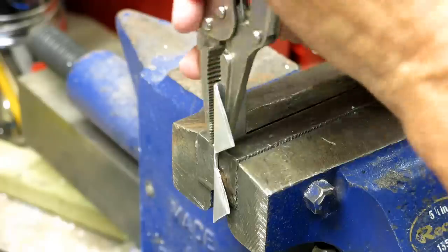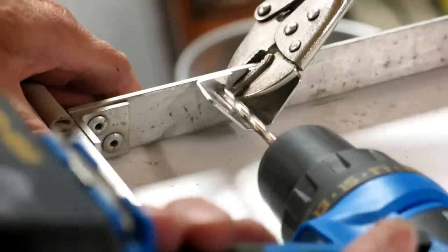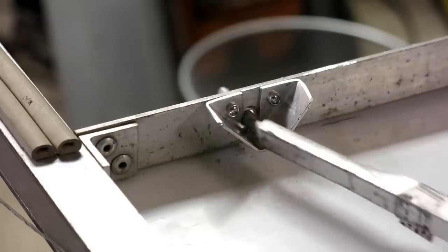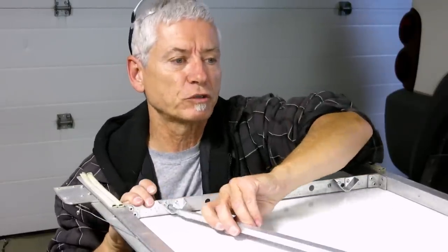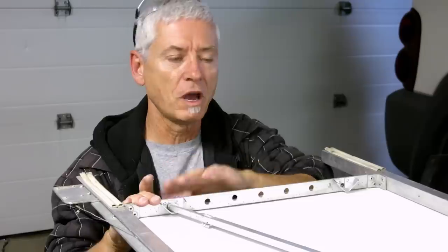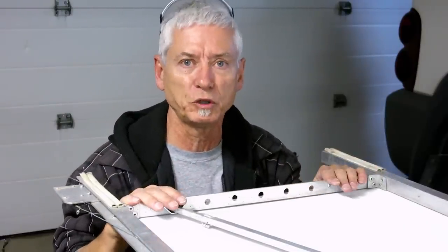After my road test I further refined the design by making guides out of aluminum to make it easy to switch the leg support around. These were secured to the top end of the panel frame with rivets. I put little aluminum guides on the edges so when you're trying to align the support from the other end it just guides it in place. I also put ventilation holes all up and down the support of the panels — this allows air to flow from the bottom of the panels up so they won't get too hot underneath.